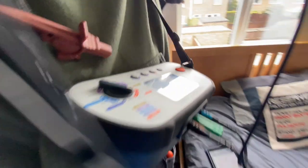One point two seven - I'm shocked. Right, we've spoken to the client - I think we've got about 25 items on the list. Obviously it's a failure since it's unsatisfactory. There are a few bad things - he did say he was getting a knock off the dishwasher, and that's not surprising since there's no CPC on that circuit. He added the bond from the water pipe to give it an earth, but that also powers some equipment down to the shed - it's quite dangerous. We're discussing a possible rewire. We'll send him the report and let him make the decision, but the amount of time fault-finding you'd spend, you may as well pay for a rewire and get it done properly.